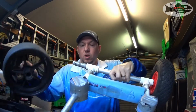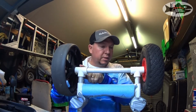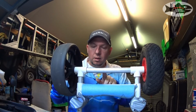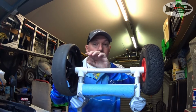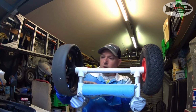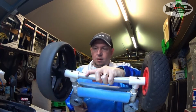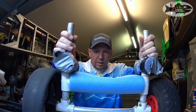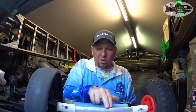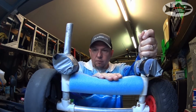That's actually quite nice. What would I change in the design? I would probably be using stainless 316 screws in here, because these screws go through the tees, the aluminium, the metal, the dowel inside and into the dowel that's inside here. As far as corrosion goes, yeah, there is a little bit of corrosion. You'd expect that. It's not 316, not marine stainless, nor marine alloy. So there's a fraction of corrosion, but for the cost of this from Bunnings, not such a big deal. And again, they may have replaced this.